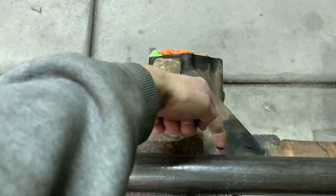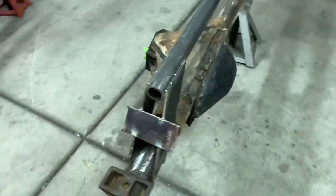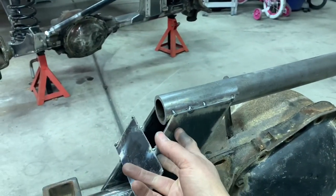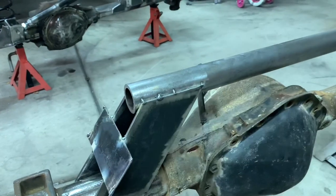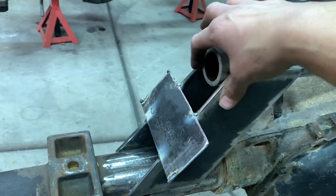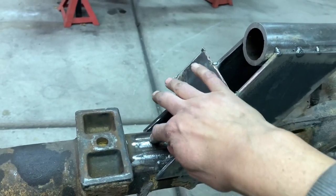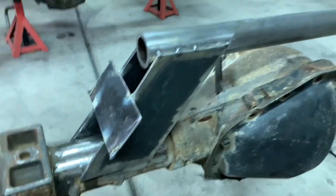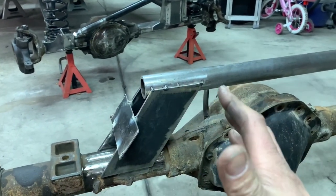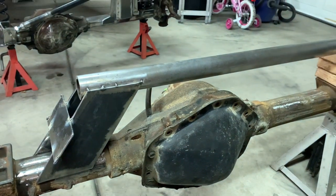It's going to have a pinion bridge - I'm going to weld a tab off of it with three half inch bolts, and then it's going to go right down to the pinion. Got the tube cleaned up, threw it in the vise, cut down all my pieces of plate - I've got four identical ones that are going to be my uprights on both sides. I tacked this one on then clocked this other one to where it gives us three inches so when we put the plate on we'll have a nice big area to burn around the axle. I figured if I build one side and make sure everything jives, then it'd be pretty easy to add the uprights on the other side.